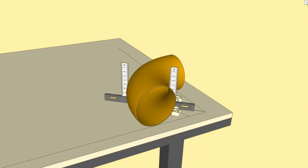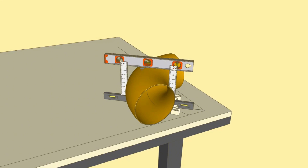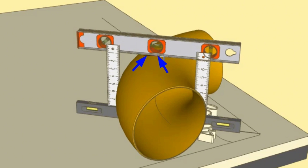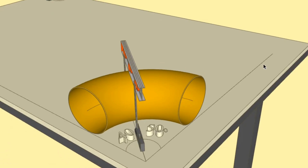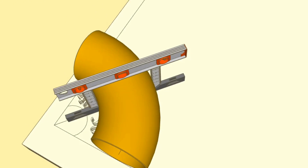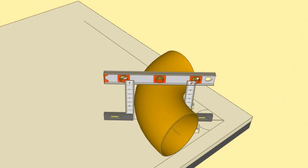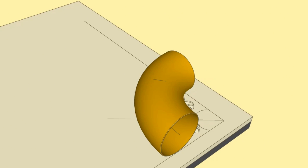In the next step we will use a spirit level. Keeping the spirit level at the right level, we put it on the 90 degree elbow with the condition of touching both Tri-square right angles. We make sure the spirit level's touching side aligns with the common line of the 50 degree and 40 degree angles, then mark the spirit level and 90 degree elbow touching points. We repeatedly check that the marking is correct and that the 90 degree elbow is in place after each marking.